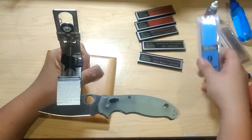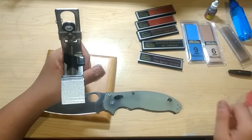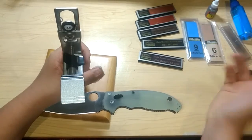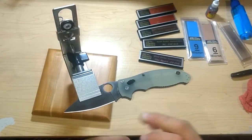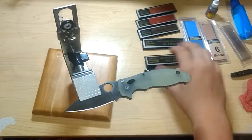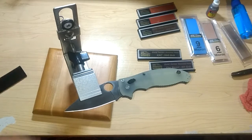No, I do not consider these to be stones. I do these differently on the strops, but they all basically end in 3 on one side, 3 on the other, and then 1 on one side and 1 on the other. That's really what the procedure is. So done with the 100 grit stone. Gonna put that aside. Go with the 140.